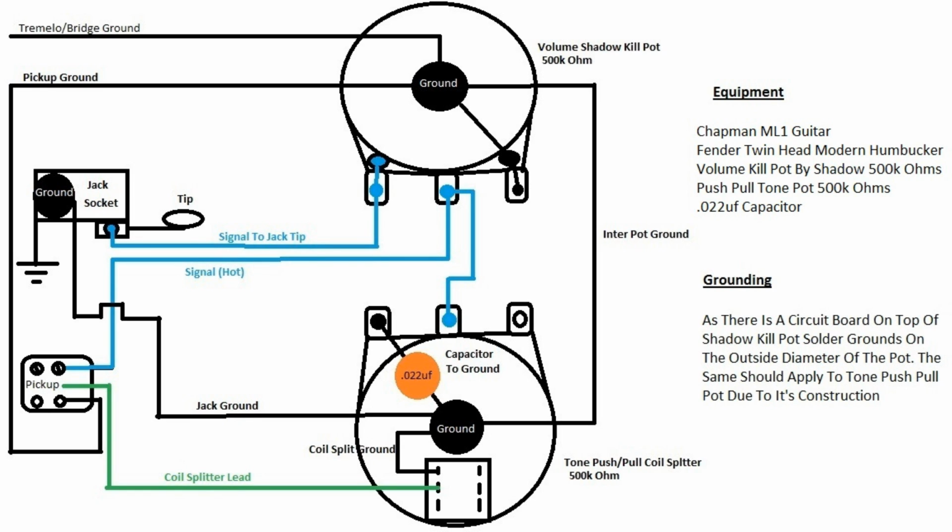Now there are a couple of other things on the pot that you must make sure are connected up. As you can notice on the left hand connector, there is another connection above the tab connection that sticks out on the pot. This is in the circuit board that sits on the top of the pot, and there are two little copper bushes, if you like. This one goes into the left hand copper bush, so you have to make a connection also from the left hand tab, left hand connector on the pot, up to this copper bush.